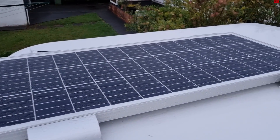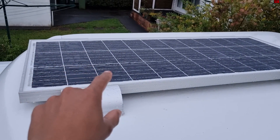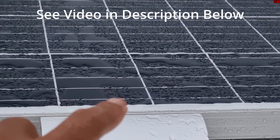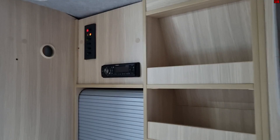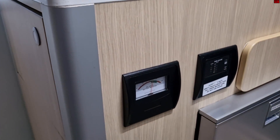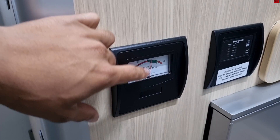Now we're going ahead and installing the new solar panel. On that stick-on solar panel I pointed out where the cells were damaged. Over time the cells get damaged on stick-on panels because they can't handle much heat. From experience, stick-on solar panels only last about seven to ten years if you're careful and parked under a carport, but when exposed to direct sunlight and UV over seven-plus years, each cell degrades. Normally one of them short circuits, shorting the whole panel out — that's why we had a zero volt condition. I've put everything back together; even on this wet rainy day with just a little daylight left, the voltage is up to nearly 13 volts.